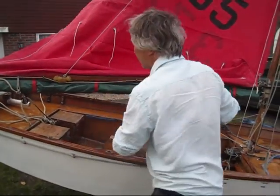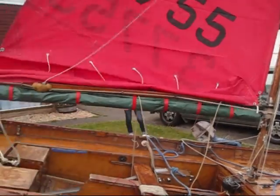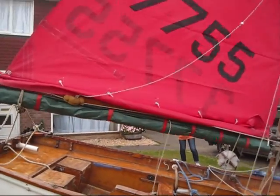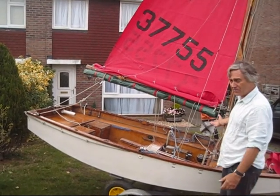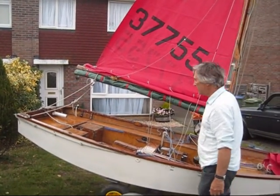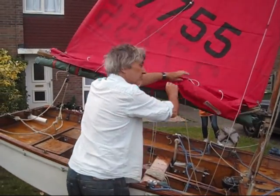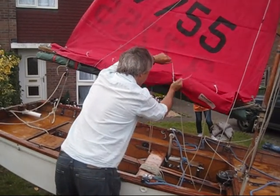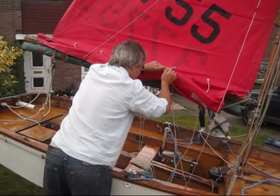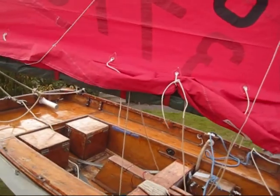These are on the starboard side — they're all on the starboard side. And here we are, so it's now reefed. It's good enough in rough heavy weather. If you want it to be tidy, there's a reef knot. And so on all of them. And that's all that's necessary to reduce canvas.